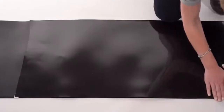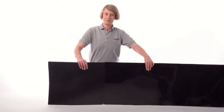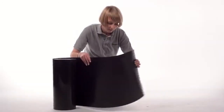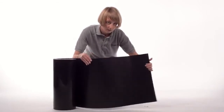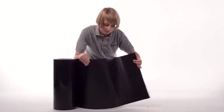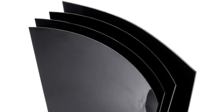It's easiest to connect the full length that you need prior to installing. Once it is assembled, simply place the barrier vertically in your trench and backfill the soil as appropriate. The geomembrane is rigid enough to stand without support in a trench, while being flexible enough to wrap around corners, pipes, and other site features. It is available in 30, 40, 60, and 80 mil thicknesses.